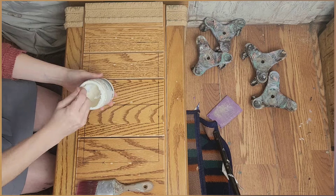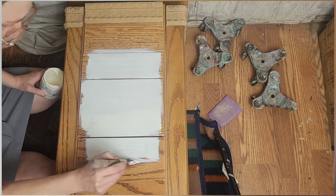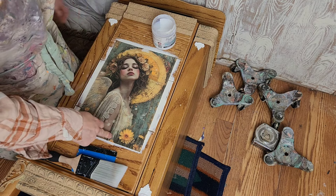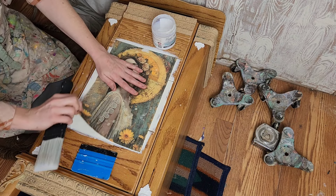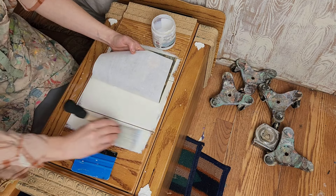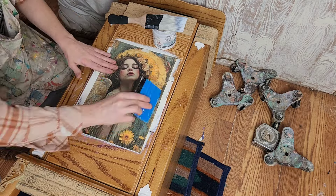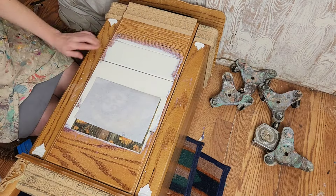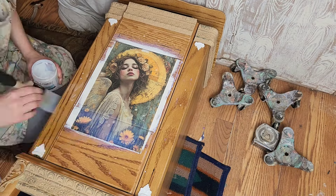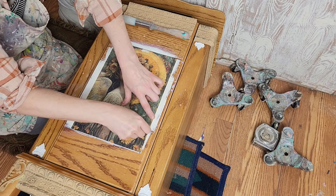I'm going to be using Paint Couture's Italian Ivory and my trusty two-inch synthetic brush to apply a nice white base for this image so all those beautiful colors and detail can really show through. Once dry, I'm going to be using a decoupage medium — you can use a top coat as well — to apply this decoupage rice paper. Before you begin, make sure that your drawers are all lined up, and I'm going to be working a section at a time, brushing the medium under the design on one half, then using a plastic tool or a piece of saran wrap to press the image down making sure there are no air bubbles, then brushing the decoupage medium over top of the entire design.